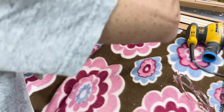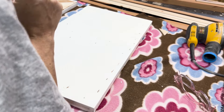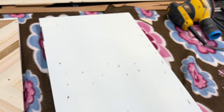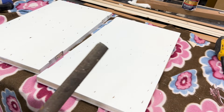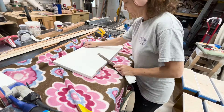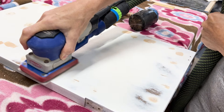I promised to show you a big screw-up, and here it is. I miscalculated what size nails to use for the cabinet doors, and because they were too long, most of them poked through the back of the doors. I couldn't hammer them back through — they'd just poke out the front — and trying to remove them would tear up the wood and ruin the doors. The only tool I had was an old metal file, which I used to file the nails down level with the surface. Then I filled all the gouges with wood filler, sanded, and re-primed.